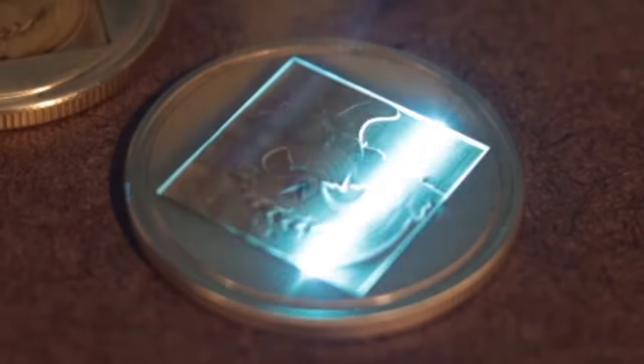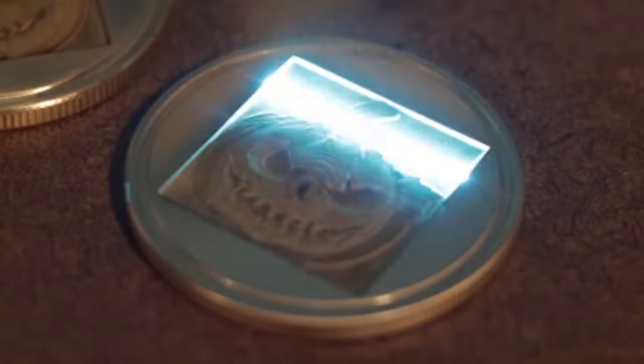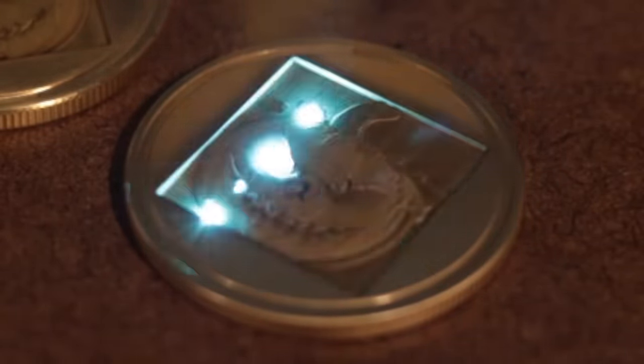While not always necessary, a good way to finish a coin like this is by sending it through a jewelry or vibratory tumbler. It'll help smooth out the edges of the design, any harsh edges, and help clean out any caked in grime or dust. And depending on your media, it can even have different effects, such as a nice polished finish.